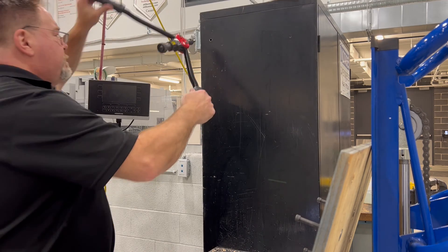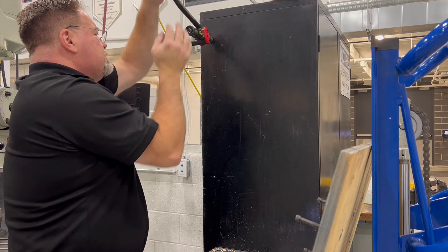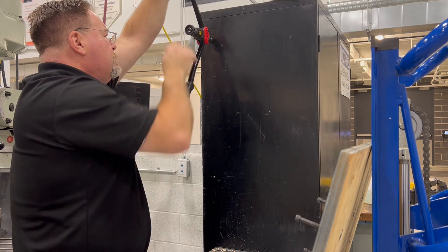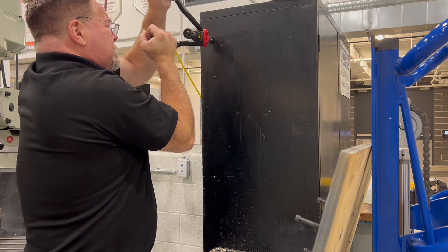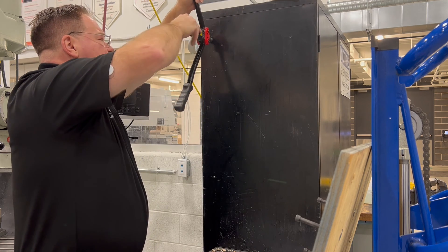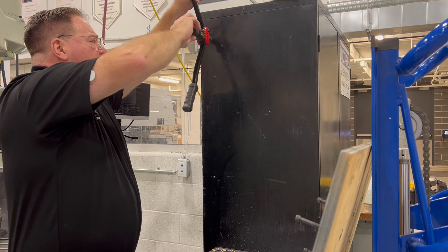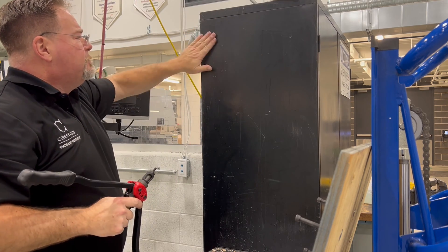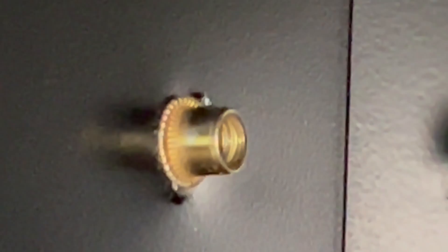This unit's already loaded. Put it into the hole, all the way in. Give it a bit of a squeeze — that was easy. Screw this in a little bit more, another squeeze. You want to go until you're bottomed out. Now you're going to unscrew this. And your nut rivet's in — nice and flush. This is what it looks like inside. No burrs. Perfection.